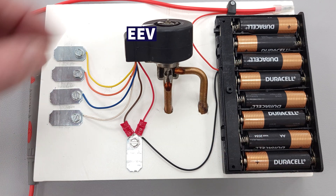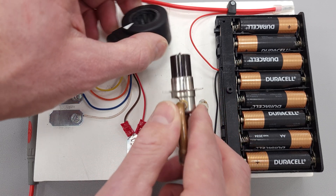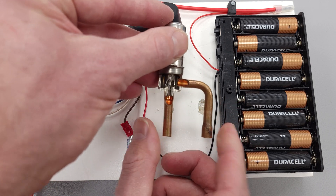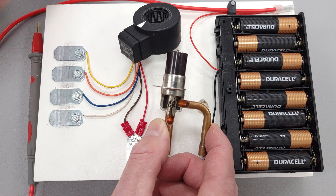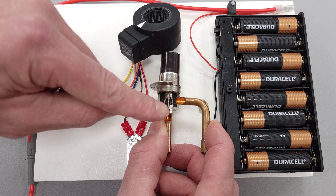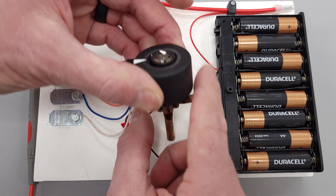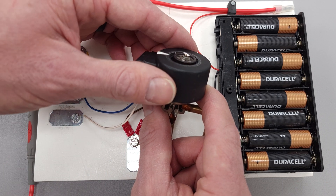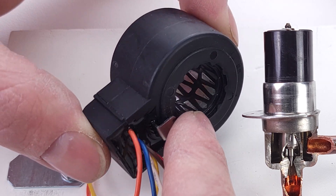Here we have our EEV. I drilled two holes on an angle into this vinyl board. First, we cut the top off with a tubing cutter — the system was empty. We cut the EEV out of the system and then took a tubing cutter to cut the shell off, taking our time. We turned it counterclockwise to get the pin out of the way, then ground it open. We also cut the top section off so that the teeth are exposed — you can see the teeth on the inside, and you'll want to show that to students to explain how this works. We have a full-length video on how this works linked in the description below.